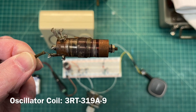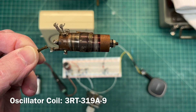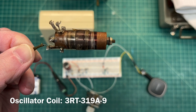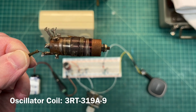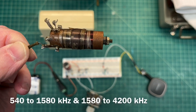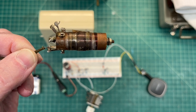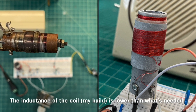You can see the oscillator coil is a problem. Just doing some DC resistance checks — I have not tried to repair it — but I thought I would go ahead and wind and create a new oscillator coil from scratch, see if I can make it work and make it track across the two bands on this little Emerson radio. I can get the loudspeaker repaired as well; that has the open field coil.